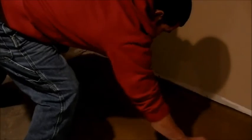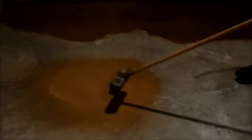We continue in a steady motion all the way through the floor — spraying color with the pump sprayer, brushing the edges, and moving forward through the whole floor. Again, you do not want to allow the color to dry before you apply the next section, because it leaves a dry line that's hard to remove once it's on the concrete. It's best to either work with two people or just work small areas at a time.